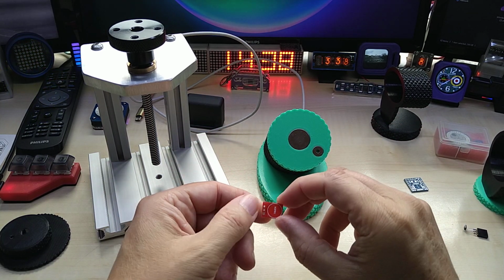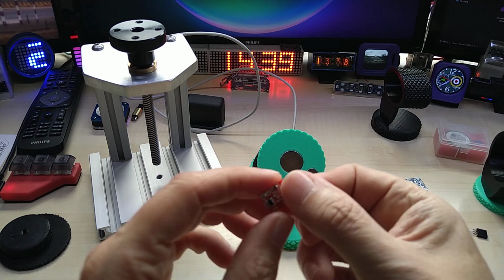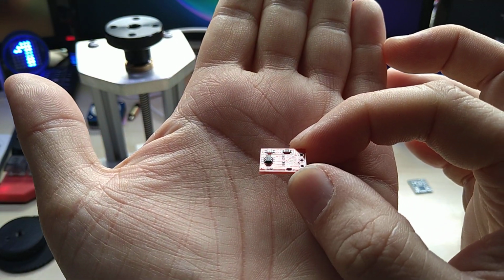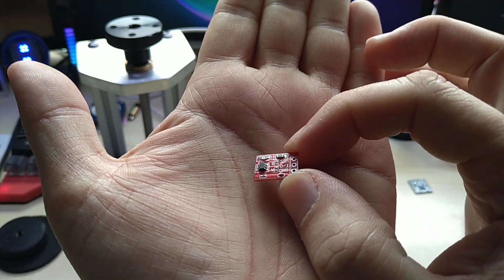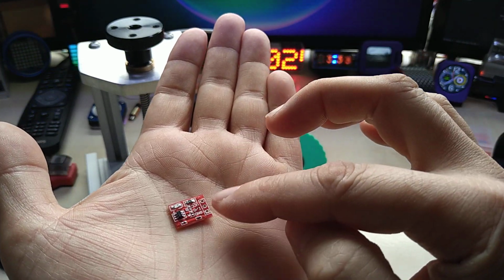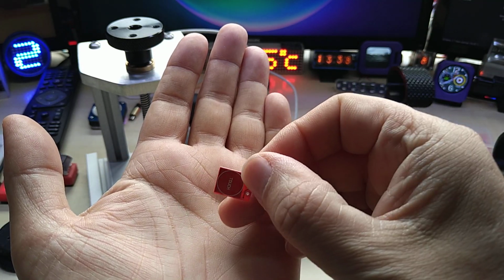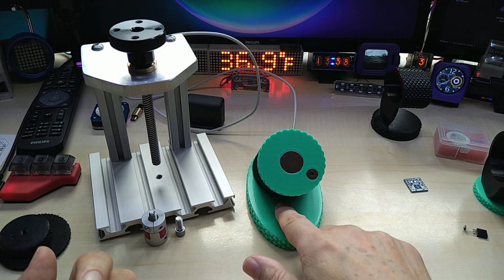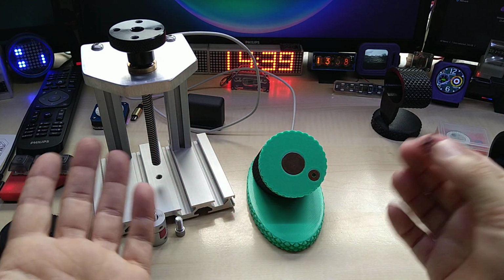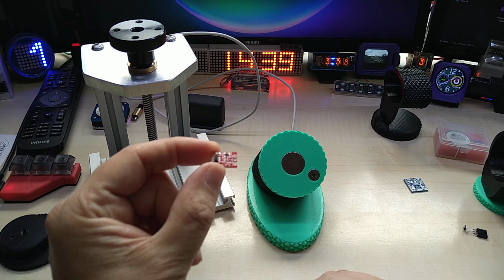I will actually put two sensors on here from the bottom. These are modules that you can buy, and you can make them as momentary switch or as a latching switch. On a latching switch they consume less than a milliamp, so it's not a problem at all. I even thought of making this battery powered, but then I said it's going to stay put somewhere and get powered. No sense of putting a LiPo battery in there.